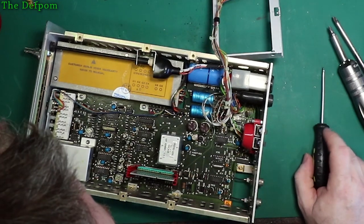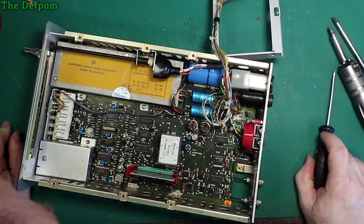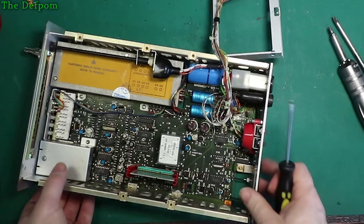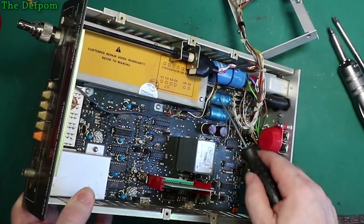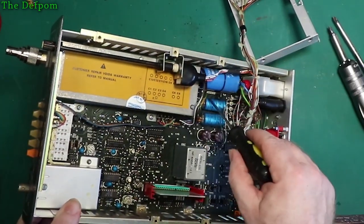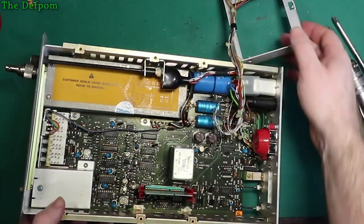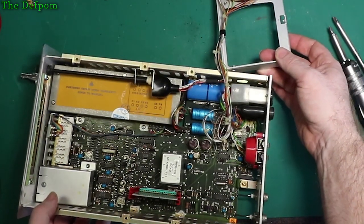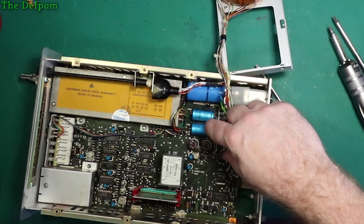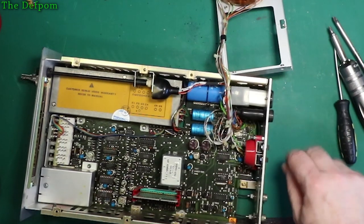So, visually, a little bit of dust, but not much. Looks fine. So just those three electrolytics in there. Those are 1000 uF, 25 volt. That one there, we have to figure out. It's got a little jumper pin on here and a header connector, which is interesting. That's actually on the diagram, I did see that before. I'm not quite sure what the situation is with it. There's also some kind of reason for that. Maybe there's an optional board or something. So the positives are this end, negative band is on that end. Positive is marked on the board as well, on the silk screen, which is good.